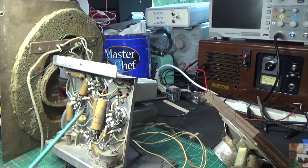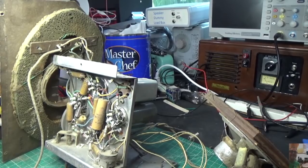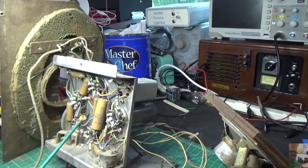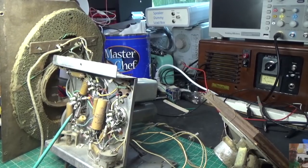I'm guessing this radio was made in 1945, and I'll tell you why. It has that rubberized wire — this is when they made the conversion from cloth wire to regular rubber-insulated wire. The problem is that most of it disintegrates. I remember when I worked on the Bing Crosby phonograph radio that was 1946, and just by looking at some of the components I'm thinking this is mid-40s. This IF right here is very small — that certainly wasn't around in the 30s.